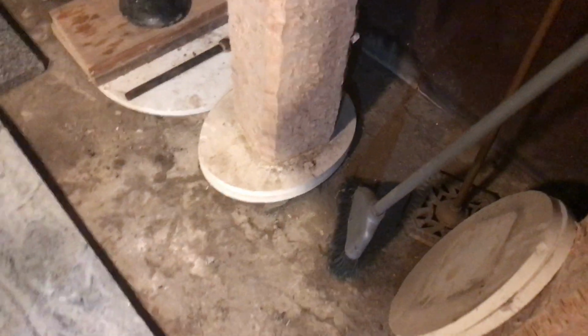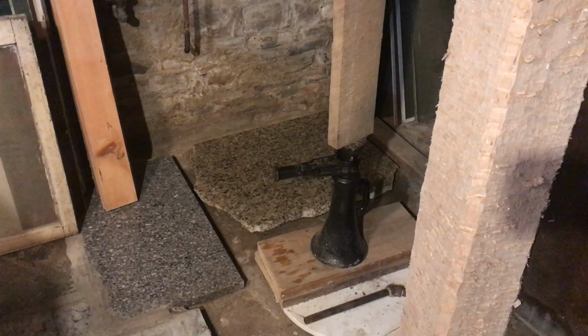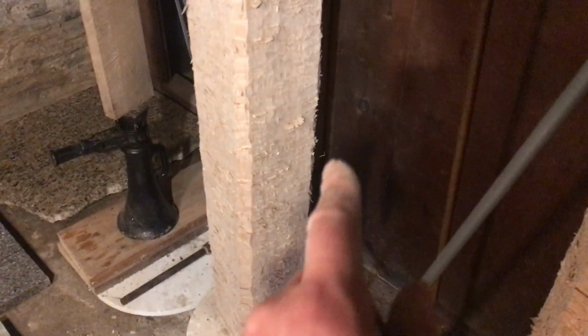And I'm not using the quartz this time. Eradicating the quartz in here. So it's going to be a natural stone piece that I'll put underneath there. Get my measurement, cut it, and then hopefully I can jack up a little bit, get it in there, screw it in, and let the jack down. And then move the jack over to here and target that one right there. First I had to get the door off, which was kind of a hassle because they aren't Phillips and they're in there good, but I got them off. I'm going to have to cut the door off at least 2 inches. So I'd have to do that too.